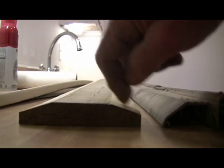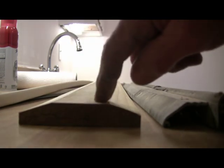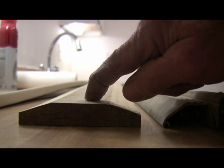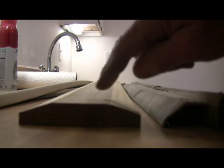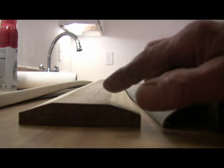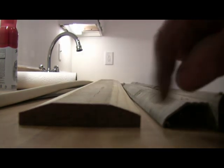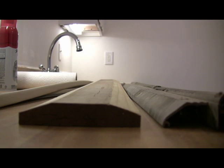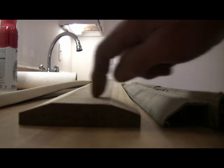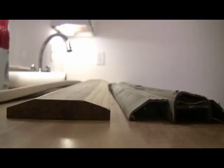What I've done is made one out of treated lumber. I've cut the two ends to keep it from being a trip hazard, and there's a wide flat area right here where the weatherstrip is going to go on the bottom of the door. We need to get this set in and then measure from here up to the bottom of the door — it's got to be exactly a half an inch. It could be less, but it cannot be more. Then I'll show you how to attach the door bottom so we can get a good weatherstrip and don't have to worry about anything getting torn up like this old one.